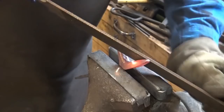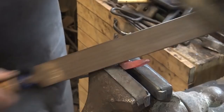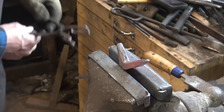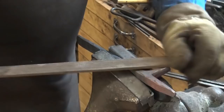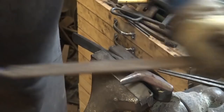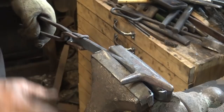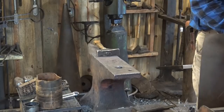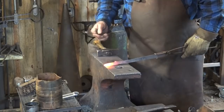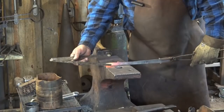A little bit of hot rasping and hot filing before you bend the fork can really make for a nicer result, and it will save you time filing at the bench later. Make sure there are no burrs — that's what we're after. This is a place where controlled heat comes in handy: we know we have an inch-and-a-half tine here and we want an inch and a half there, so I'm going to cool off the part that needs to stay straight in my can of water, and then see if I can bend this very controlled right at that bend point.